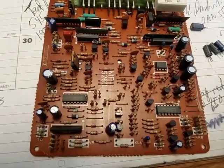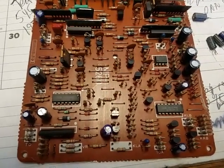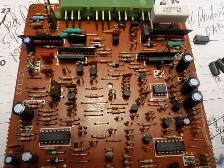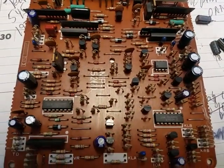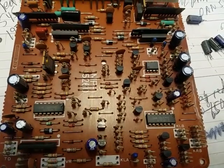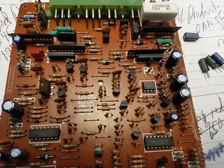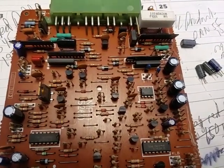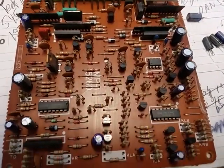This is just a feedback controller for a computer-controlled carburetor. It doesn't have a processor, a crystal, or software in it. It simply looks at the O2 sensor and modulates the duty cycle to the carburetor air bleed valve to keep the O2 sensor switching up and down, regulate the CO, and allow the catalytic converter to work.